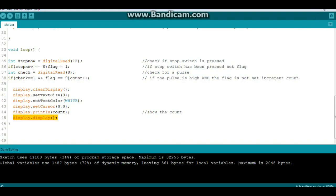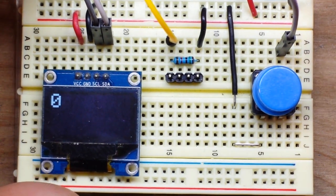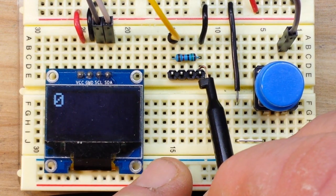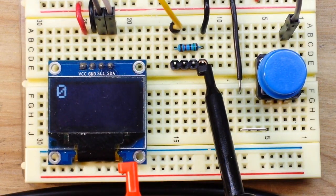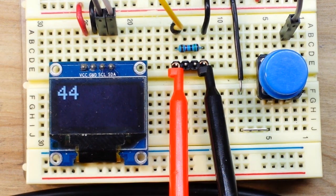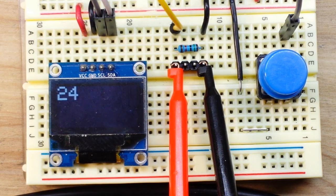Okay, you've seen the code, it has been uploaded. Let's power up the Arduino — and now she's ready to start counting. Let's hook up our frequency generator, function generator here, and watch it start counting. When we want it to stop, you press the blue button. When you want to reset it, you press the Arduino's reset button and she resets. It's as simple as that.